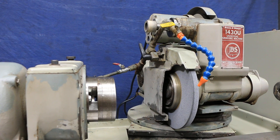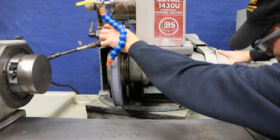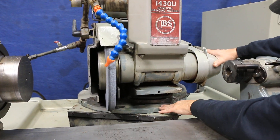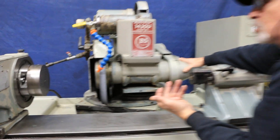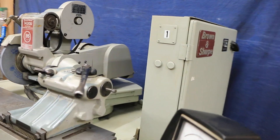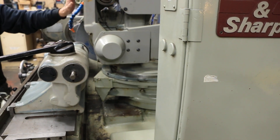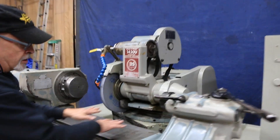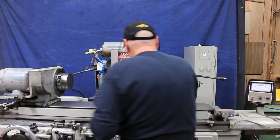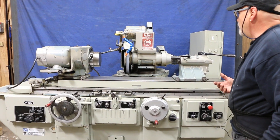You can see from this picture here that the top column swivels at this point. But I could swivel this bottom plate around so that the narrow part would be in the front and we'd be able to get a lot closer to our part. Or if you had a large part, you swivel this intermediate plate the opposite way and the wheel will be further back. So the wheel can do something along the lines of this - you've got one, two, and three actual swivel points on this wheel head.